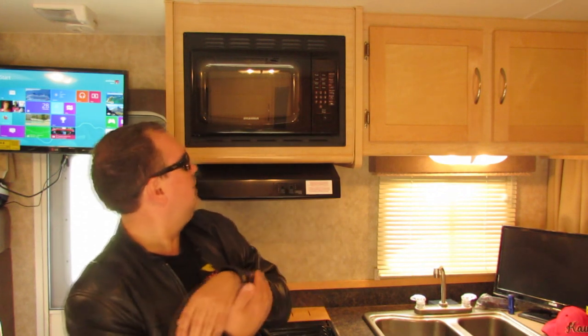I just put in a 3,000 watt inverter with a 5,000 watt surge, and this microwave — it's a Sylvania, it only draws 1,350 watts total. But it keeps blowing a 30 amp fuse on my inverter. The install was done by me and a certified electrician and we can't figure out why. Everything else works — my flat panel screen is running off the inverter right now, all the lower loads work fine. I can't run a toaster either, that blew a fuse too. I'll show you what I've got and maybe one of you can give me some advice.